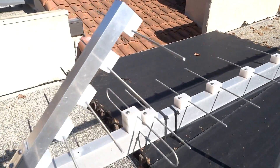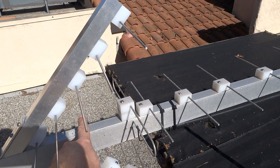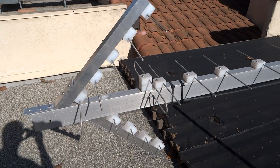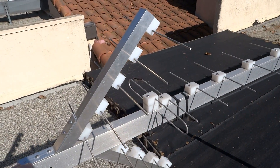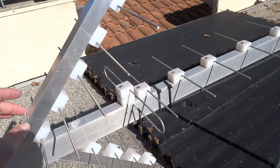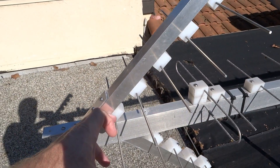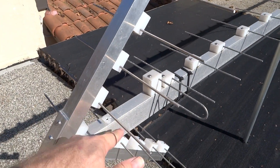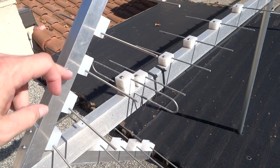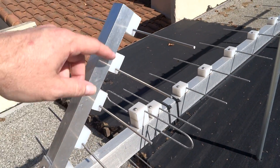The other main change I did is this — I installed a corner reflector. I took out the single reflector I had and did this corner reflector setup. The corner reflector itself, I had a hard time finding designs for them online. There are plenty of designs for the Yagi itself, but for the corner reflector I just couldn't find designs. So for the lengths of the individual reflectors here I went with the same length as the single reflector I had before and just replicated them along. I also didn't know how far back I should go, or how many, or what spacing I should use.